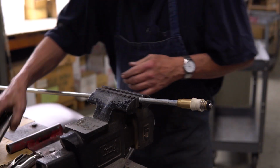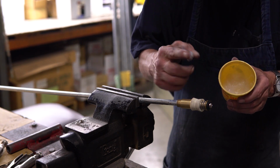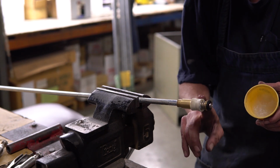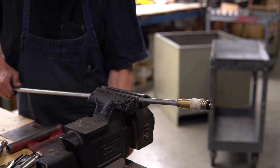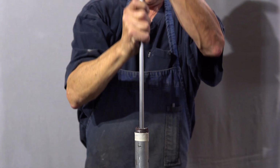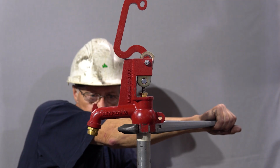With the new plunger on the rod, it's time to reassemble the hydrant. Begin by lubricating the new plunger with silicone, a non-petroleum based lubricant. Petroleum-based lubricants such as Vaseline will damage the new plunger. Once the plunger is lubricated, apply a thread sealing compound or pipe dope to the threads of the standpipe. With the lever open, insert the head assembly and operating rod back into the standpipe. Tighten the head casting with the pipe wrenches to the tape mark you made earlier.